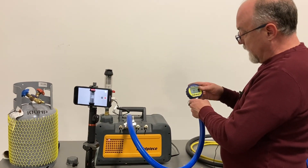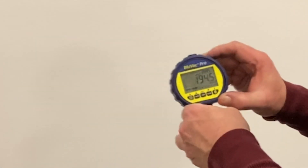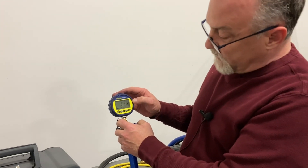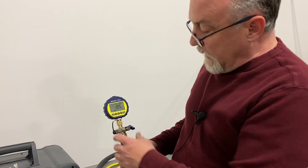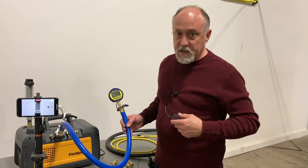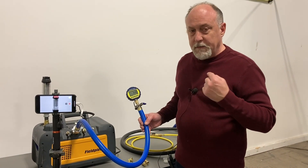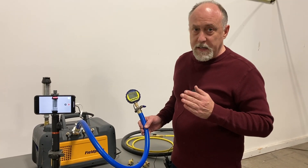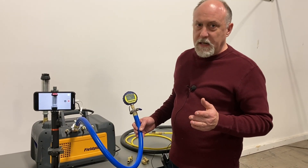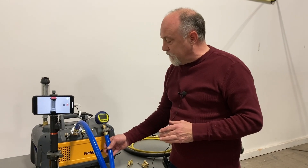I'll disconnect this hose and connect the True Blue to see the difference. Notice each time I cap this off, the flow drops down because viscous flow is over and we're into transitional/molecular flow range. So we'll hook this up to the gauge. As soon as we get this on, you can see we're already down below 200 microns, approaching 100 microns and coming down very very quickly. This is why it's so important to have a hose engineered for vacuum and not repurposed — this hose is going to take all the work the pump is doing, move it to the end of the hose, and give us faster, deeper vacuums and much better dehydration. We're down to 75 microns and it'll be down to 50 microns in just a few seconds — it just takes minutes for this to actually happen.